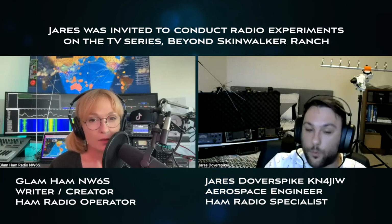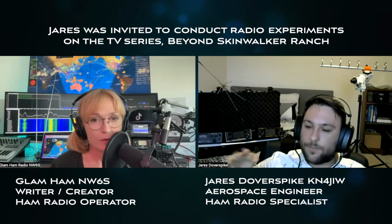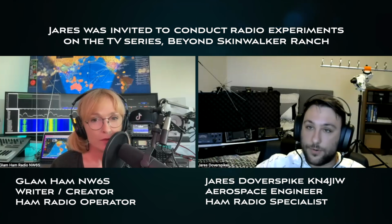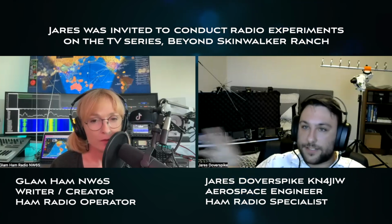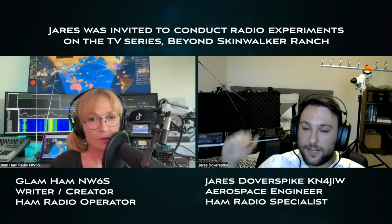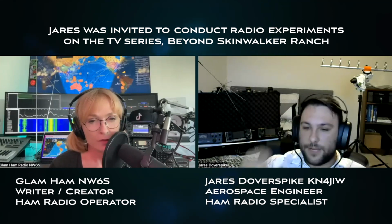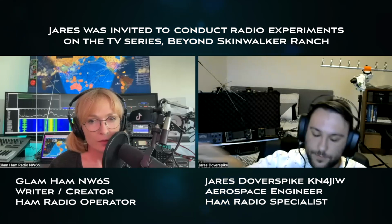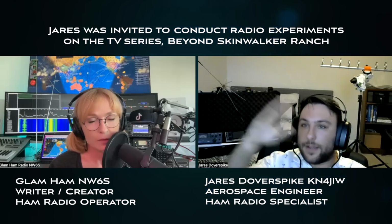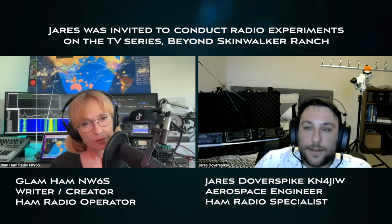But if we didn't see anything there and we were to move up, I would have moved up, I believe, to 435-something. The radio that I have doesn't get directly to the harmonics, so I was going to be somewhere in the 1.6 region, just because they also see not directly at 1.6, but around that band as well. So, doing what I can with my specific radios and making sure, like I was talking about, how sanitized my signals are, I want to make sure I'm following all the FCC guidelines. And so I'm not going to get a lot of energy into the 1.6 region, but it might be enough that it excites something.